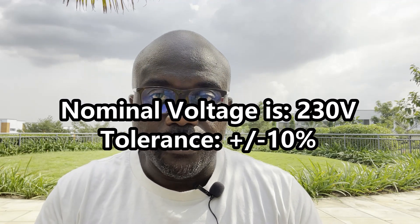Some items will be 230 volts — for example, air conditioning and your lighting — these types of items will typically be 220 volts. So you always need some element of 220 volts in your house. However, you may want some sockets at 120 volts for certain equipment you're bringing with you — I've even seen ceiling fans that are 120 volts. At every socket location you have a choice: you can have one that's 220 volts and one that's 110 volts. The 220-volt sockets are physically larger, so you can easily differentiate them. You might also put a different finish — a chrome finish — on the 110-volt ones. Just find a way to differentiate between the 110 and 220-volt outlets. A shaver socket is always 110 anyway, so there's no issue there.